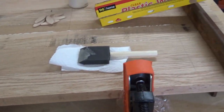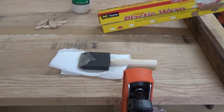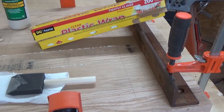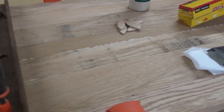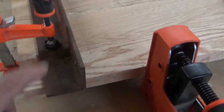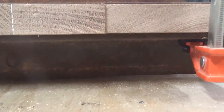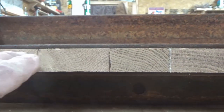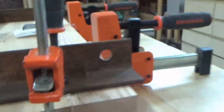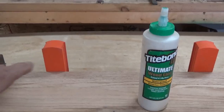I've got my Jorgensen clamps and I've had good luck with these. You don't need to spend a fortune on clamps. One thing you don't want to do is over-tighten them, because you'll press all the glue out and you're not going to have a solid, reliable joint. I tighten these up incrementally. I have pieces of angle iron top and bottom — these two clamps keep things flat, and the other two clamps compress the boards together.